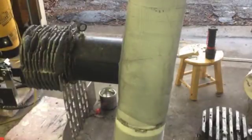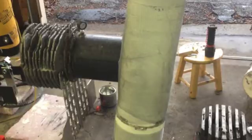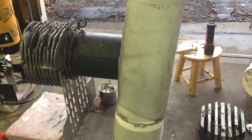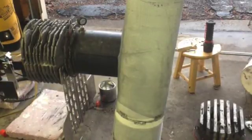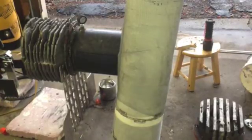We cut out disks of fiberboard and stacked them up, which has worked pretty well. We've had to extend the length of the displacer to about 40 inches, and that's what you'll see here — after they've been stacked, with hot versus cold sections separated by a buffer and painted with a ceramic paint. At the hot end it uses fiberboard, and at the cold end it uses closed-cell foam.